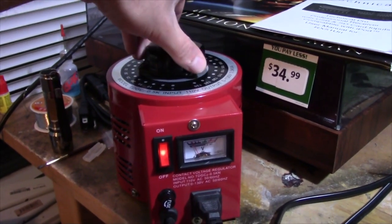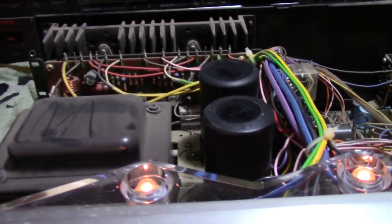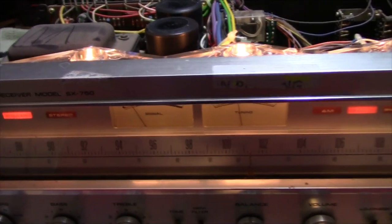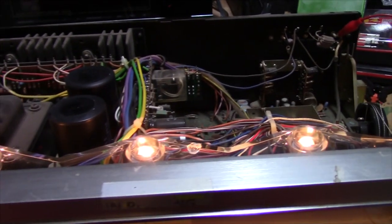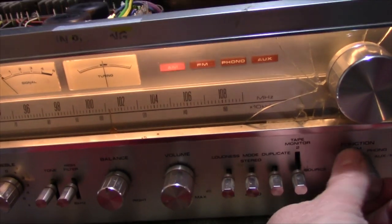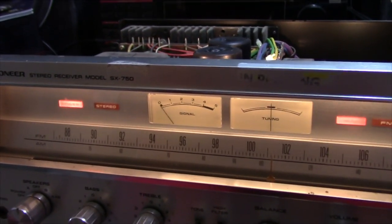Okay, we're at about 25 volts according to this, and we've got lights — all three of them are lit, which is surprising. Let's take it up a little bit more. Oh, we heard a protection relay click in, and that's only at about 55 volts. We're at about 95 right now. Nothing has gone boom, there's no smell of anything burning. Let's go ahead and just take it up all the way. I think we're good to go. All the switches are off, all our indicators are working.